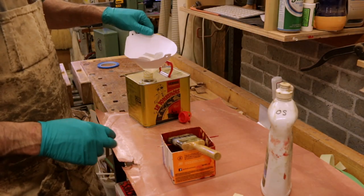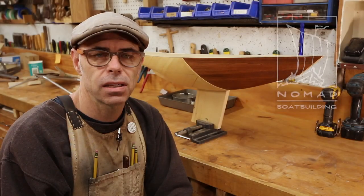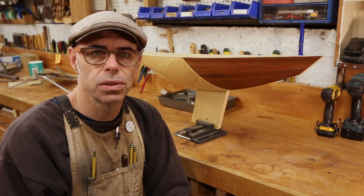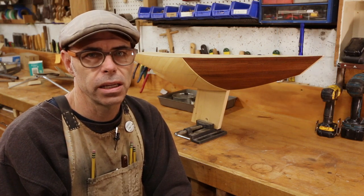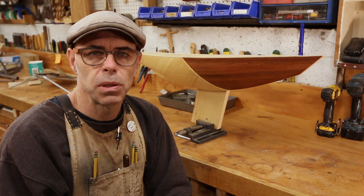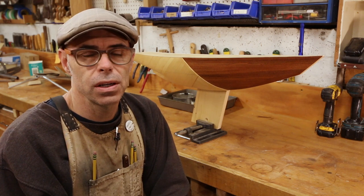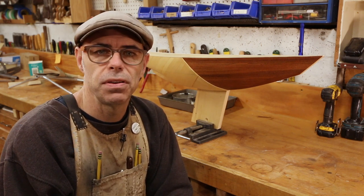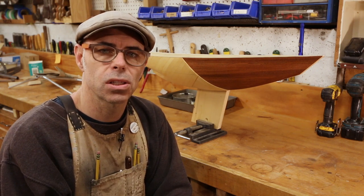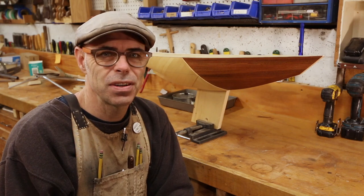I keep the paint filter around and if I have any leftover varnish it goes back into the can, but it gets filtered on its way. After this, a few more coats of varnish will go on. At the time I shot this it was summertime — I opened the doors and had work to do outside of the shop, so it's a perfect opportunity to just lay on coats of varnish as a base coat. Next we'll flip that hull over and get working on the interior, and we'll return to varnishing at the end of the project. I hope those varnishing tips were useful to you. These videos are supported by my followers on Patreon — if you could help us out over there I really appreciate that. You can find links in the description or up in the corner. Don't forget you can also subscribe and like and watch some of my other videos — that helps me out too. Ciao for now, folks, I'll see you later.